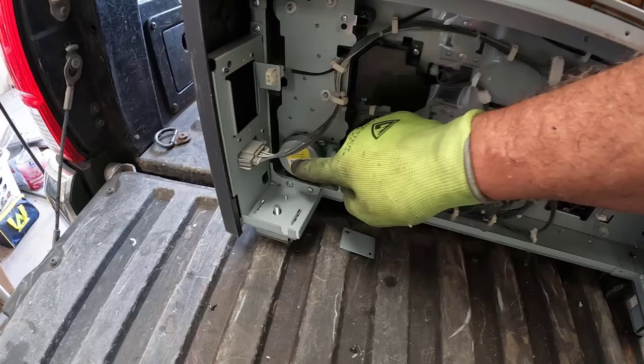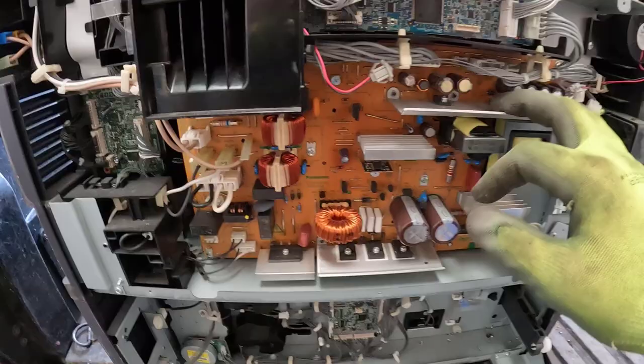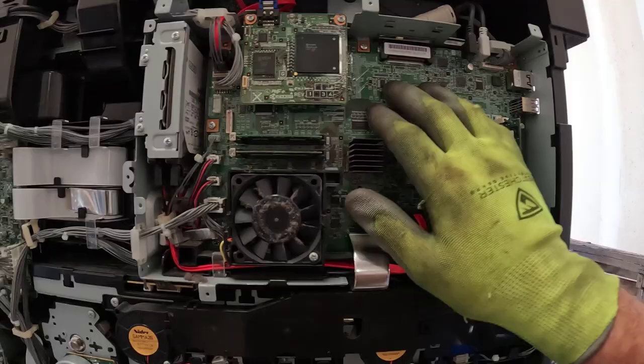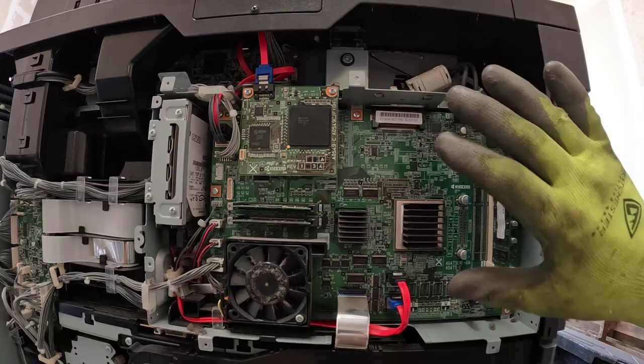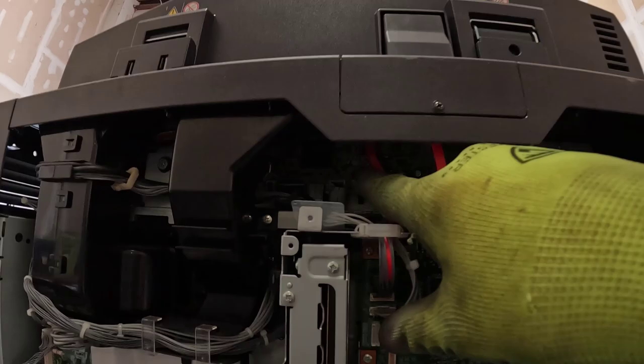You can see we've got this kind of motor, and these motors are all over the place. We've got some fans. This will be a peripheral low here probably. Power boards, you're gonna have some nice copper toroids on them and some aluminum heat sinks. Peripheral low, more motors, peripheral low, peripheral high, and another peripheral high daughter card here. Big old gold cornered BGA. So if you are into depopulating boards, there's some stuff here that you can depopulate as well. And then you've got 1, 2, 3 RAM sticks here. And there's another peripheral hiding back in there.